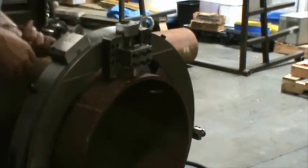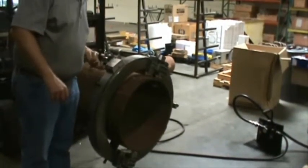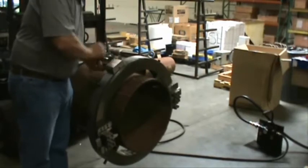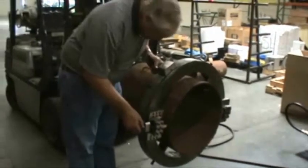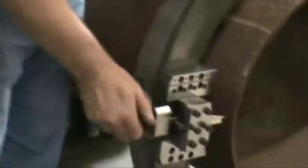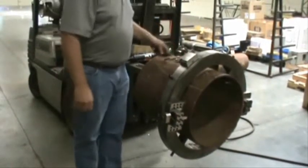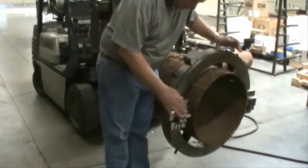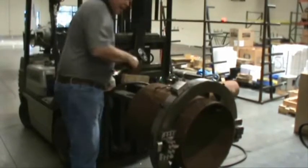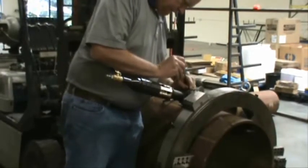Then we're going to rotate the head, and we want to make sure the bevel bit is farther back — we will engage that a little bit after. We want the cutting to start first and the bevel to follow afterwards. We want to make sure this is back far enough so when it starts feeding in, it won't start feeding in until after the cutting bit is in deep enough to start your bevel. After we've adjusted our tool bits, adjusted our pads, and got everything aligned, we want to set up and put the air motor on and lock it in.